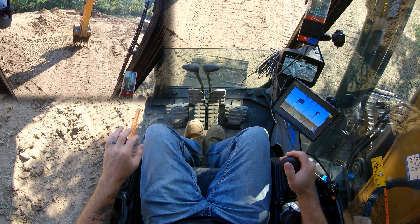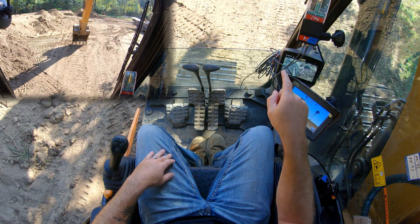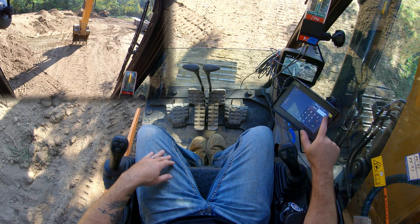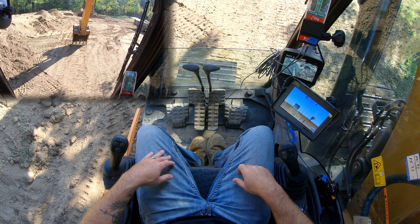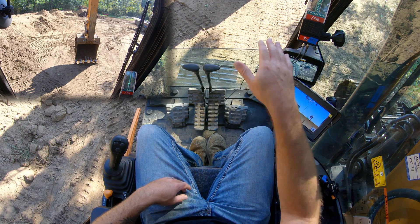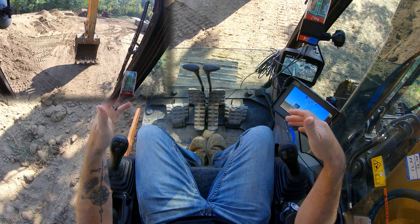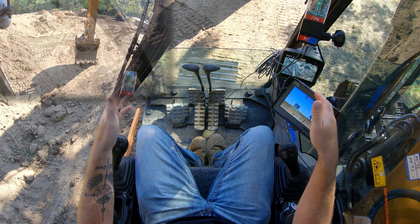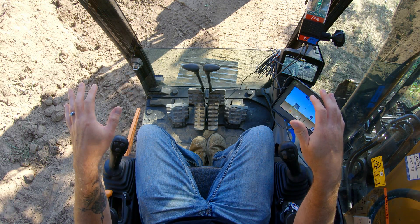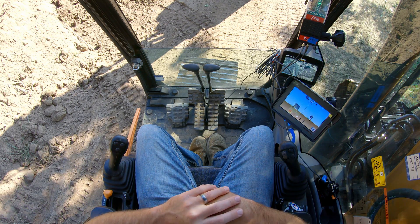Once we dig that down and I move the machine, if I want to re-benchmark back in the hole — now our hole is at two feet deep — I have to go in here and say the actual is zero, this is grade. From then forward, we can go back to using the zero button and it will re-zero us inside the trench. I know that's a little confusing — it is kind of hard to talk about when you aren't actively working in a trench — but hopefully that gives you an idea of how you re-zero this and how you create your benchmark. If you have any questions, feel free to comment down below. Thanks for watching and we'll catch you on the next episode.